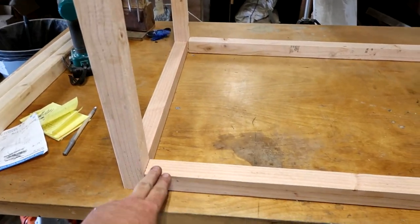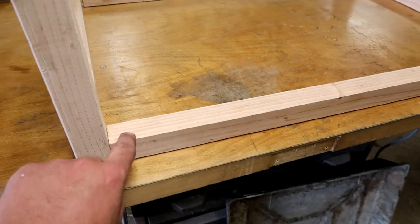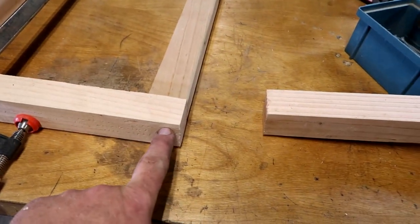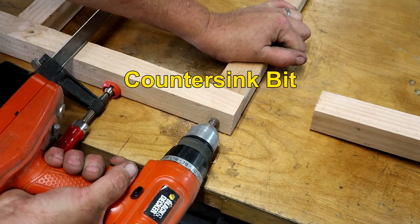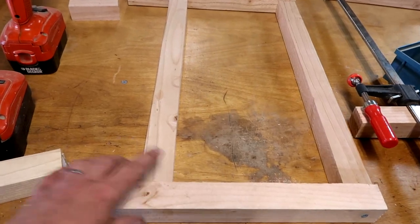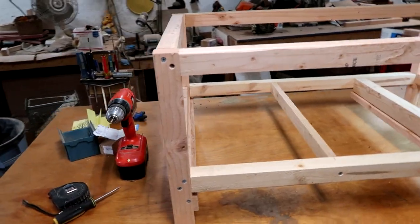It's a work in progress — it'll be crystal clear by the end. We're going to build it upside down, so this is actually the top. You get an idea of the basic shape. I'm just going to put screws in here and hold this all together. This is the side — always use your clamps. I put in a temporary piece so I can put the clamp in the middle and screw right here. This bar needs to be four inches from the bottom to allow room for the poop tray. Easiest way to do that is just cut a four-inch block, place it in there, put your clamp on, and screw it together.